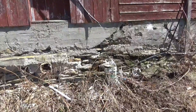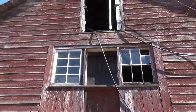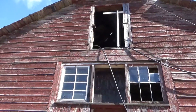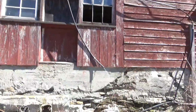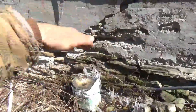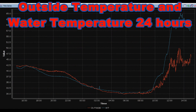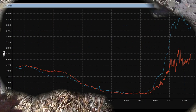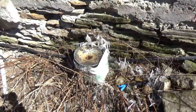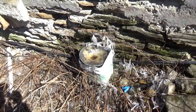Here you can see the overflow from the reservoir — two 55-gallon drums up in the second story of the barn for now. You can see that this is running even through the freeze overnight last night. I find that anything that doesn't go below 27 degrees — because the water is moving — we're able to keep it from freezing.